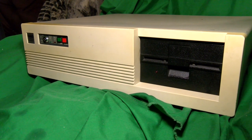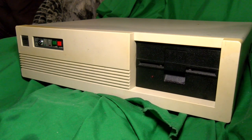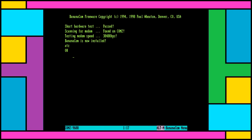There are several of these, and it's actually where you start getting into dodgy things, like the science of machines that used 8088s or 8086 and derivative processors, but weren't really PC compatible. You could put any peripheral or feature at just about any address, interrupts, and DMA in theory and have it work, but how would you write a program for that? If your program only talks to the operating system, and all of those machines ran the same operating system with the same APIs, then it might just work. I think something like this might have gone on with machines that ran CP/M, and IBM even offered that operating system as an option for the PC at one time.